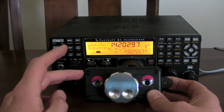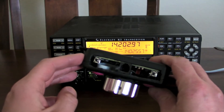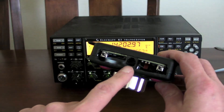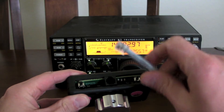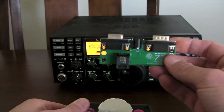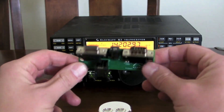So that's the biggest change in this next revision. I've replaced all the serial ports with this six-conductor phone jack — basically RJ-12. So it's just a regular phone cable now, and the serial ports have been moved to this little board here, which is nothing but traces and serial ports.